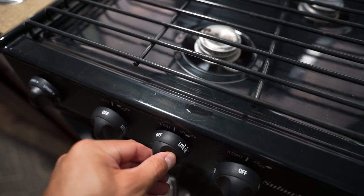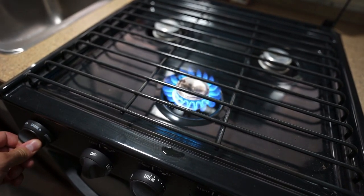Make sure your propane is on and don't freeze out your propane lines. If you're having trouble getting your hot water heater started and it seems like everything else is in order, you can try essentially priming your propane system. The best way I like doing that is to turn on your stove — that way you know gas is flowing and you can rule out any other problems with your gas system. As long as that's going, your hot water heater should work. It's as simple as that: gas is on, water's in your water heater, turn it to pilot, light it, hold for about 30 seconds, flip it to on, set your temperature, and you should be good to go.